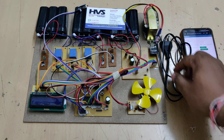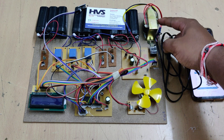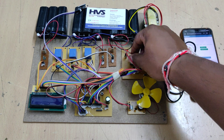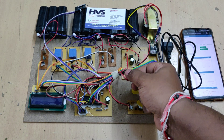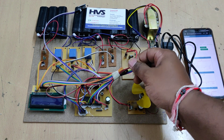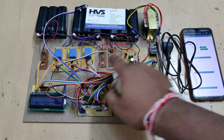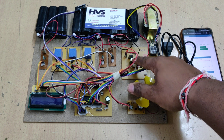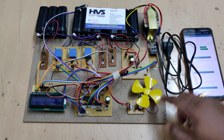For the power flow: 230V AC input goes to a transformer which steps down to 12V AC, then converted to 12V DC and 5V DC. The 12V DC is the input to the battery packs through the relays, and the 5V DC is regulated using a 7805 regulator. On the charging circuit we can see diodes acting as a rectifier, a capacitor acting as a filter, and the regulator stepping down 12V DC to 5V DC.